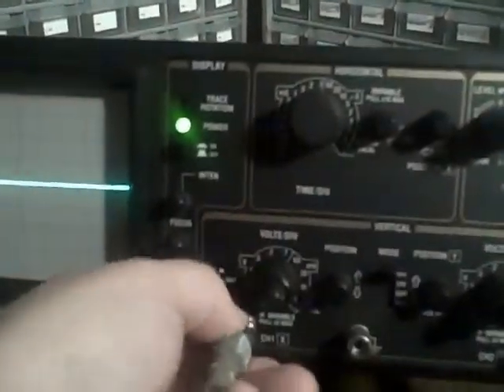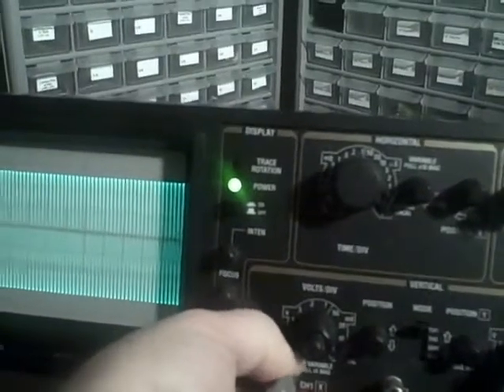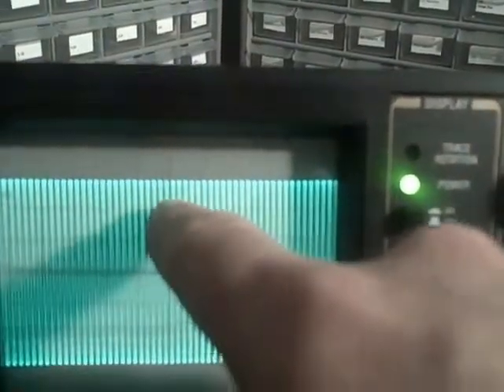Now I'm plugging into the Tenma. What we see is that we are now 1.2 divisions down and 1.2 divisions up — so that's 2.8 divisions up, 2.8 divisions down at this frequency. And that would be equivalent to 3 dB. Let's check our frequency now to find out what frequency we're running at, because this scope is rated at 20 megahertz and I believe we're running at about 25 right now. I'm going to connect up my frequency counter.